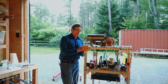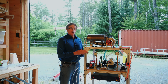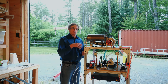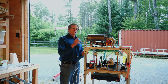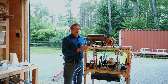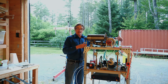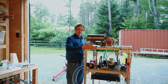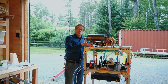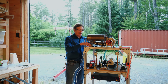You may notice this frame structure — I rely on this a lot. This is from a company called 8020; that's the actual name of the company. They make extruded aluminum rails as well as components that fit together sort of like a big-boy version of an erector set. Very convenient. Once you've built the frame, a nice way to mount the jet engine is to put some flat panels of relatively thick aluminum on the top. Cut them to the outer dimensions of the stand — in this case 24 inches by 30 inches, or 60 cm by 75 cm — and about 5 mm thickness, or 3/16ths, is a good thickness. Aluminum is easy to work with, and it's physically strong enough that we can bolt all of our components to the tabletop. It's not just a cover; it's actually a structural element.